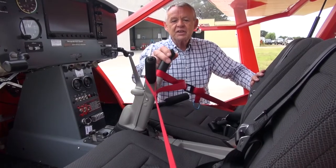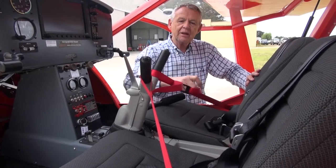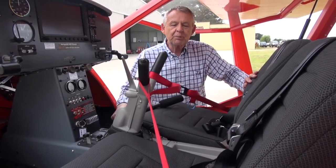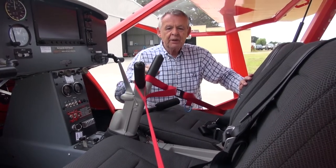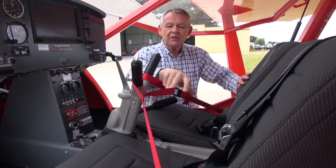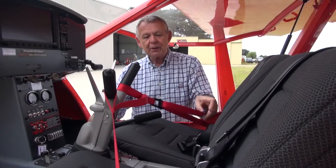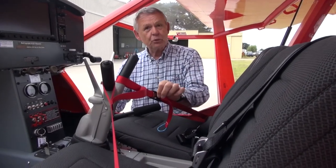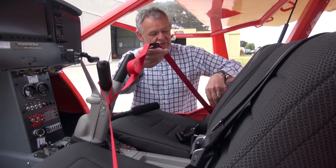Apart from the Y-stick, one of the most obvious things you'll notice straight away is this bright red control lock, which we've specially developed for the Y-shaped handles in the Foxbat and the Vixen. It's very simple — as you can see the controls are well locked with another strap in between. The strap is tightened by pulling on the adjuster strap here and loosened by simply squeezing the adjuster buckle here, pulling away and lifting off the top of the stick.